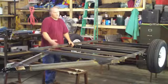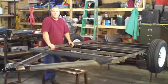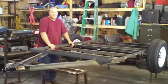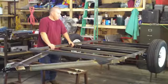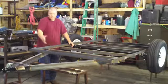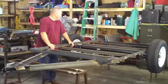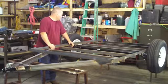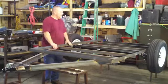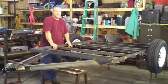I'm kind of glad it happened because I'd hate for you to be welding everything up and have it look like a banana when you're done. If I would have used a wire feed, it maybe wouldn't have put quite as much heat — a stick welder burns a little hotter. I was using 7018s and I had her cranked up pretty good. The hitch and everything came out fine, nothing moved there. So we're ready now — I'm going to tack our sides on, I've got fenders to put on, and we'll go from there.